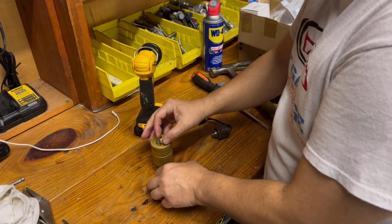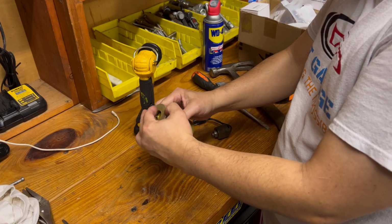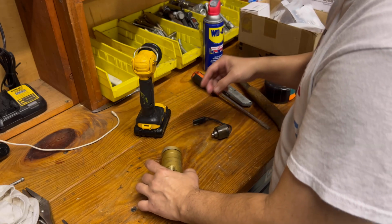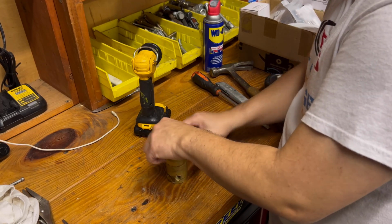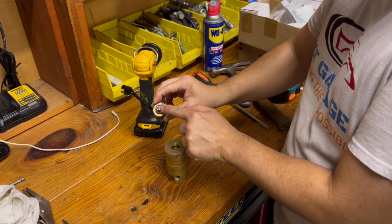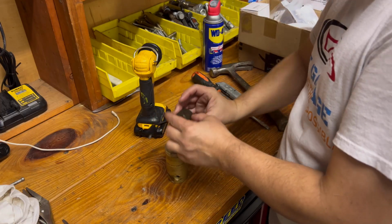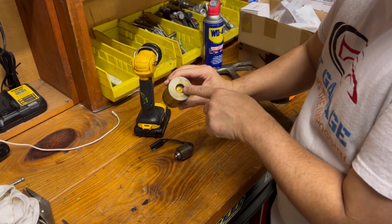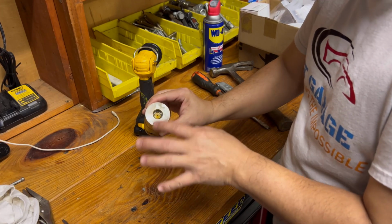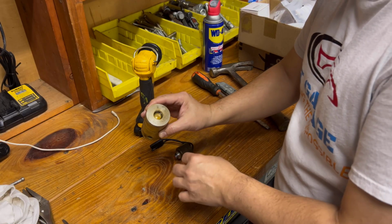And so when you have this whole system bolted down like that, and the spring is engaged, the top piece right here is acting as a seal, and it's always sealed. So this activator is sealing on this hole right here. So in normal condition, when the fan is not on, this hole is sealed up. So there's no pressure allowed to go to the fan clutch.